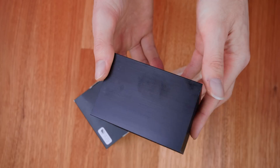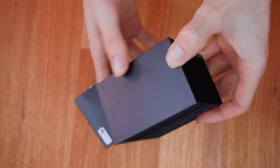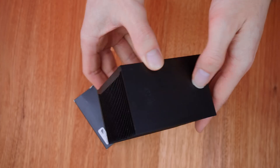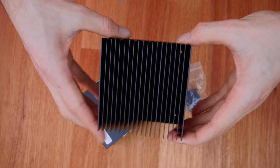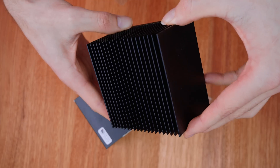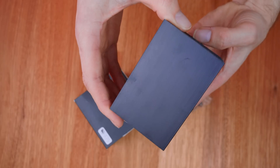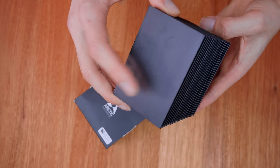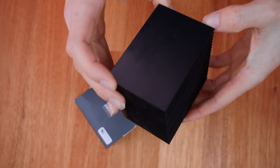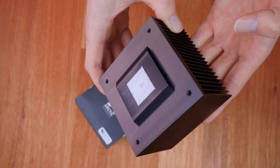That black anodized aluminium looks really nice, but it also grabs fingerprints and any thermal paste you accidentally get on it. Keep your hands clean, and if you're using another thermal paste like Arctic MX4, be aware it will stick to this surface and is very hard to remove. Isopropyl alcohol works, but repeated wiping could cause other problems down the line.